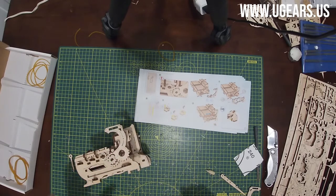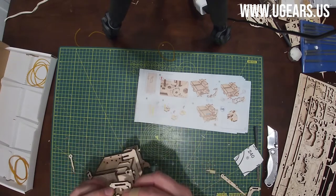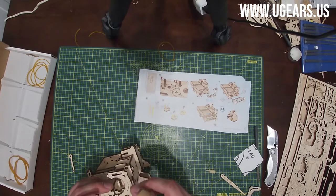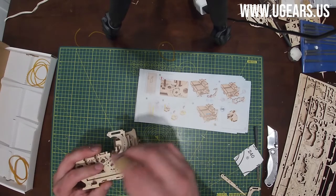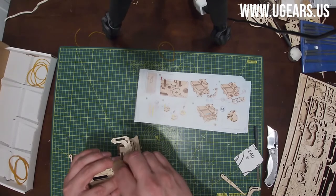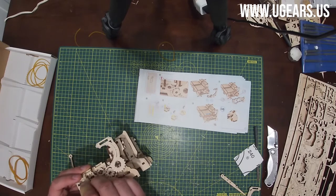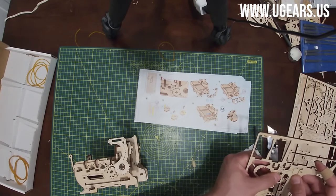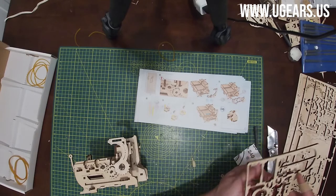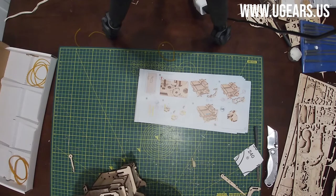Now once all these are matching, we do need to wax those little gears on here. Once all these marks are matching as shown, do wax the little sticking out tabs, because they're all going to be in the rotational. And easier to insert if you wax them. And then we put 59A, which is on board number 3 at the top here, right at the center. That goes over all these little tabs, locking everything in place.